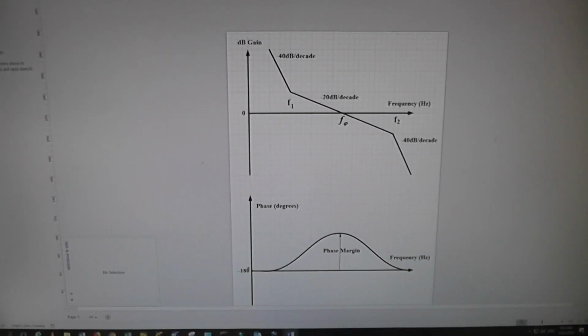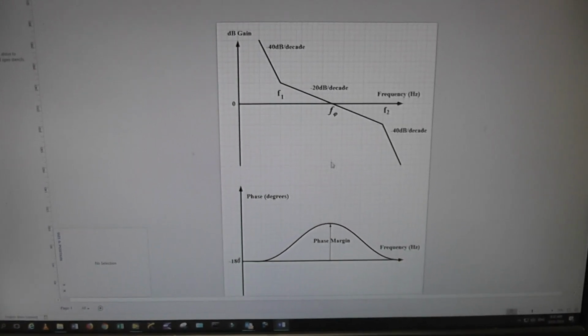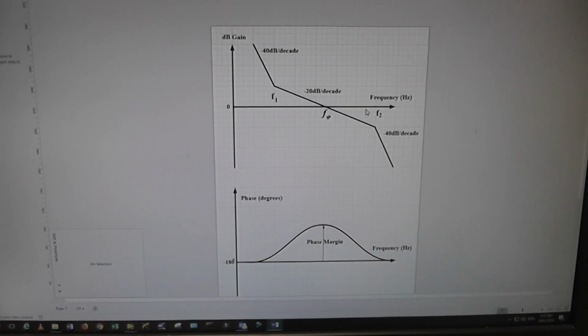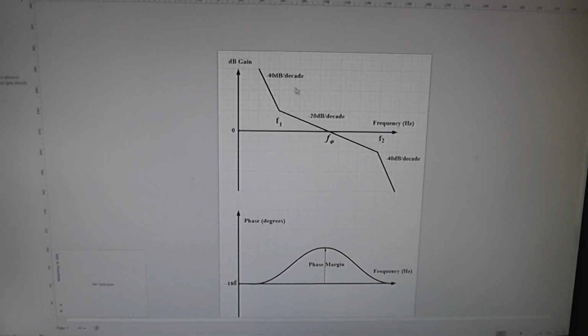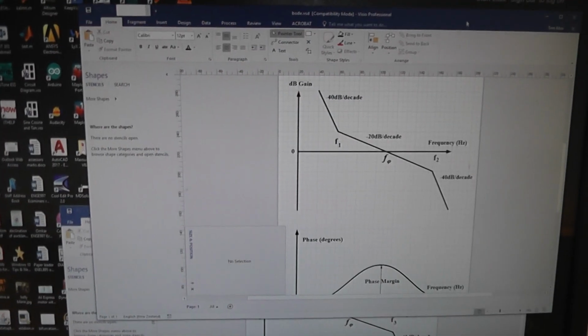so that's pretty good. But what I've done is one stage further. I've added a second phase advance to get even more phase, and really this comes down and kind of goes flat. Asymptotically it goes flat, but in real life it sort of sneaks through. Hopefully you only want one unity gain crossing, otherwise there's problems there as well.